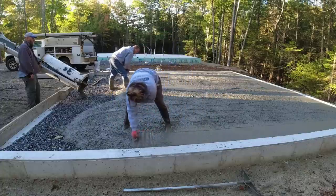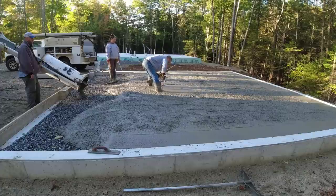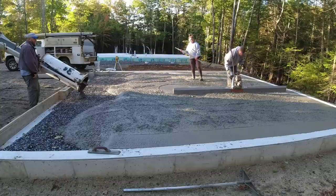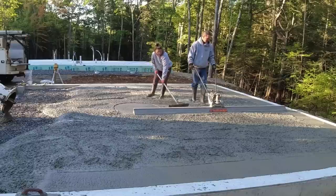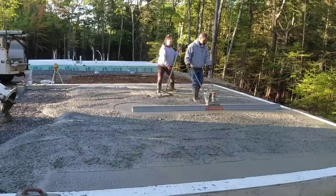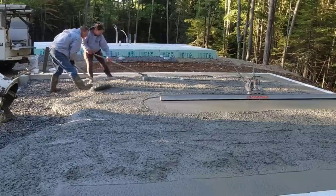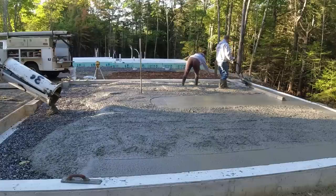Tia's gone around and magged all the edges for me, so I can use those as my wet screed line on the outside. When I'm using a power screed like this, I don't really like to ride it on top of the hard concrete wall — it just doesn't vibrate as well — so we like to ride both edges of it on the wet concrete. That's basically what I call a wet pad. I'm looking at both ends making sure they're scoring and not digging down too deep. I want to leave a little bit of a line in the wet pad — that tells me the pad is flat — and then I use the wet pad on both sides to screed off from.